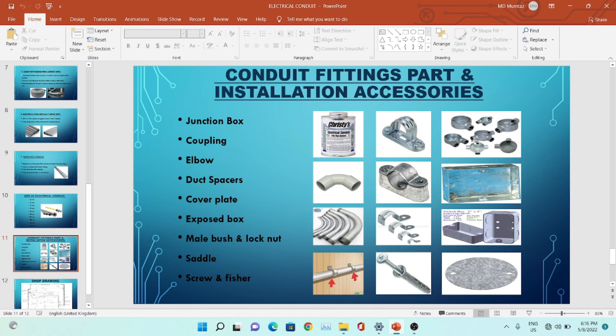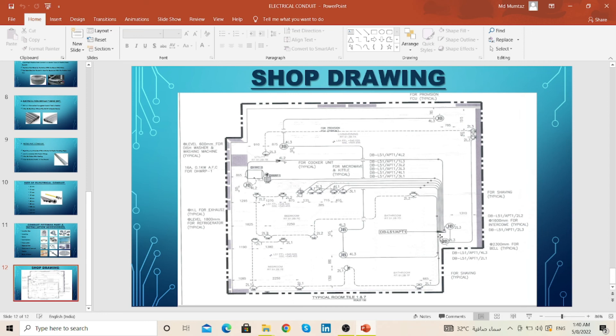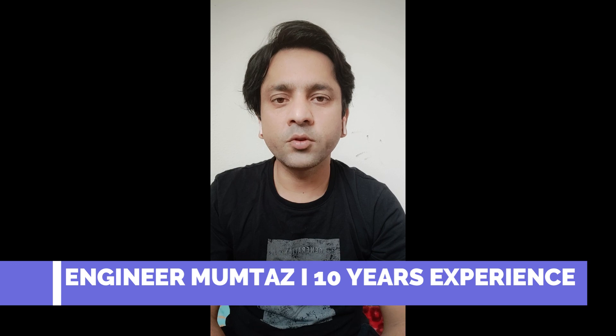This is a V junction box. We also have the back box, the junction box cover. Now, looking at the schematic drawing, we have a panel here, junction boxes, and sockets. The sockets are looped from each other — from the panel the conduit runs and connects to the socket, then loops to the next socket continuously. If the conduit is on the wall it will be a rigid conduit; if it is inside the wall it should be a PVC conduit. I hope you understand. Don't forget to subscribe and wait for the next video. Thank you for watching.